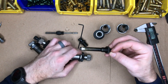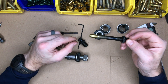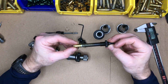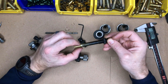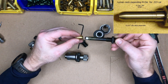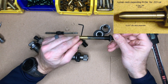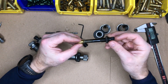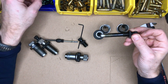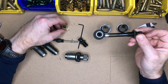The last tool for resizing is an expanding die. This is really good for getting very consistent neck sizing. If you really want to get neck tension perfect, most major die makers like Sinclair will make expanding dies. You will need them for straight-wall cartridges like 9, 45, 10mm, and 40 — the main thing is it's going to flare the edge of that cartridge and allow you to seat the projectile much easier.